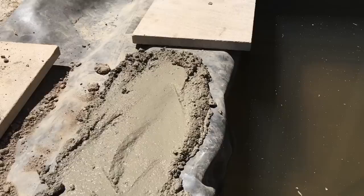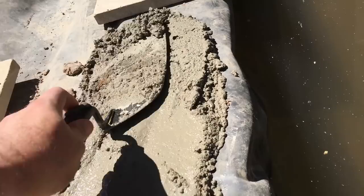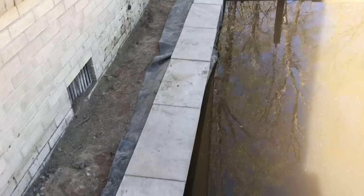We are laying cement right onto the rubber liner, trying to keep as much as possible out. This is just going to lock all of these together — we've done all the way around so far to the back corner, so that'll be one firm base under the whole thing. It'll lock it together; it's not going to necessarily keep them from falling in if somebody stands on the edge, but it's definitely going to help. We're hot and sweaty and heading back to Home Depot to get some more pond rocks.